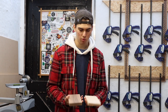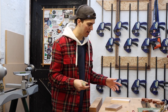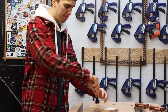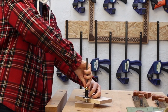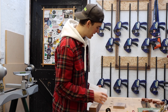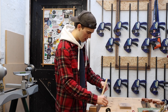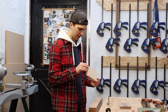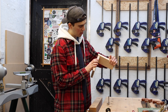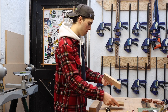I've got a bit of ash and a bit of walnut — two contrasting bits of wood so you're going to see the dovetail really cleanly. Normally when people are cutting dovetails the first step is to put the boards on top of each other, lay the marking gauge on top, measure the thickness and then scribe that all the way around the board. But what we're gonna do is actually mark the dovetail first. I'm looking at the grain because when I flush the joint off, if the grain is going upwards I'm gonna get some tear out — so I want the grain going away from me.